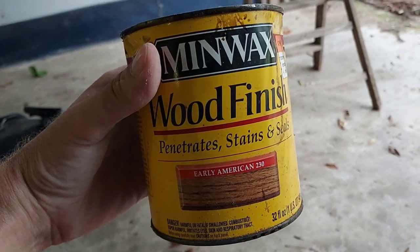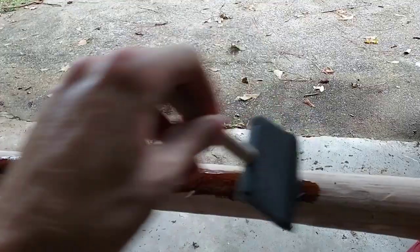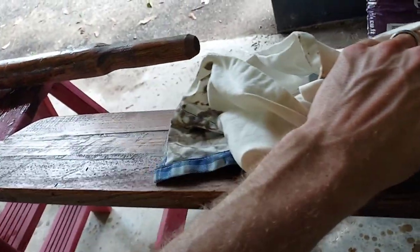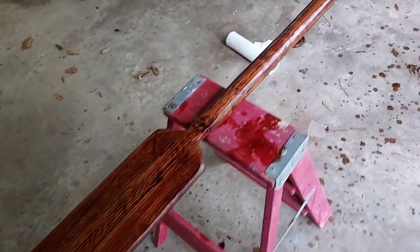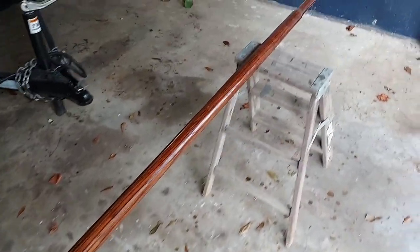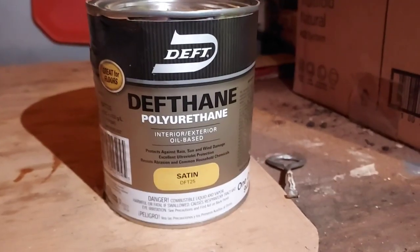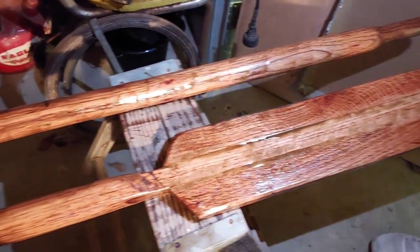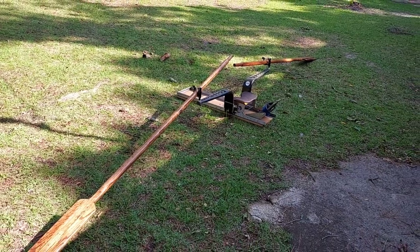Filled in some gaps with the wood putty, filled in some of the bug holes with wood putty. Put some stain on, wipe off the excess — just follow the instructions on the Minwax can. And they really started looking good at this point; I was getting pretty happy. Then I got oil-based polyurethane for as much protection as I could get, and I put three coats of that on there, letting it dry between coats. And this is what we ended up with.